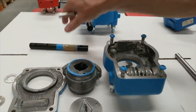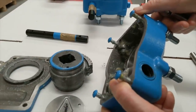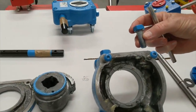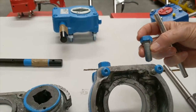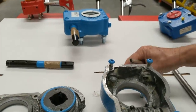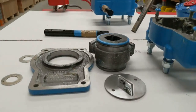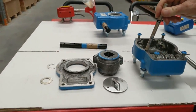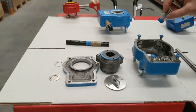Going back to the Rotorq unit, it has a similar drive device and the drive itself has a seal on the end. However, the stops are plain metal with no o-ring seal — they've been sealed with what looks like PTFE sealant. If you open and close them a number of times, there's a chance water could get inside. The housing also has rings top and bottom for the drive assembly, but two things are missing compared to the Process Systems unit: there's no gasket between the top and bottom, and no seal on the stops.